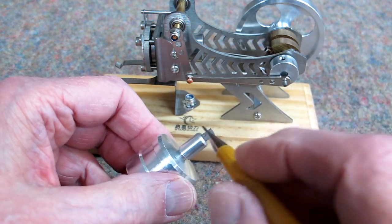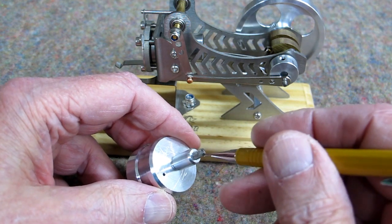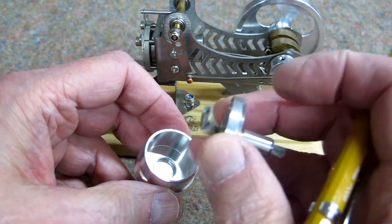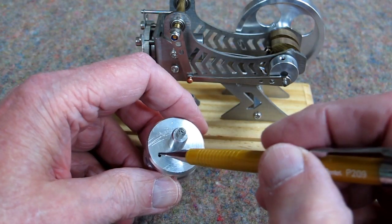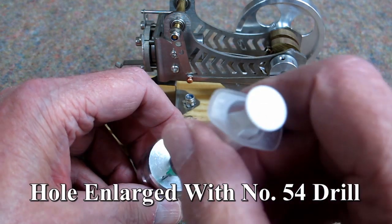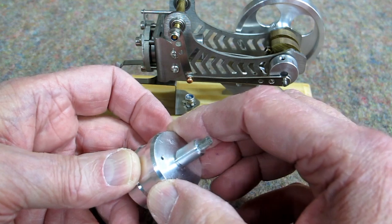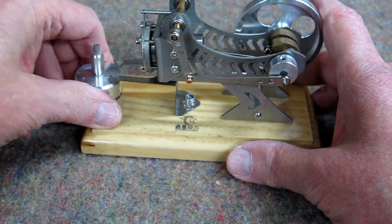The alcohol burner does not have a cotton wick — it has a piece of screen wire that's rolled up, and it's going to wick the alcohol up by capillary action. Before we get started, I'll measure how much you can put in there. It's got a vent hole in this cap, and that was too small to get any of my syringes in, so I drilled that hole out to a number 54. This cap just pushes down on there, so you don't want to overfill it or you'll have alcohol everywhere.